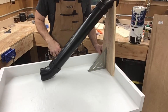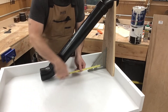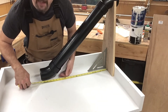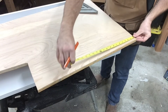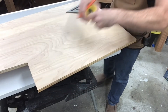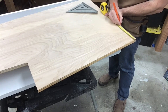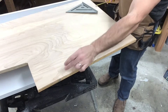I have the stand tucked into the corner here to keep it stable, with my square pushed up nice and tight. I'm going to measure along here, just about to the bottom of the pipe — looks like about 21 inches. We're going to measure up the side 21 inches, come down to the base, and make this about 6 inches wide. This is the part that will attach to the upright, and then it's going to taper down with a cutout for the pipe.